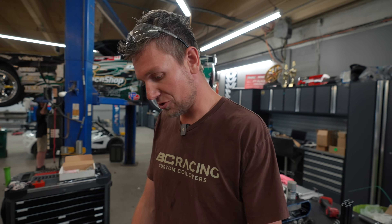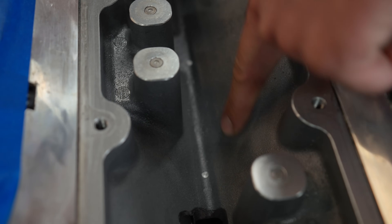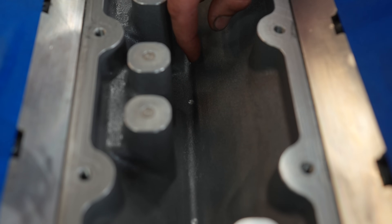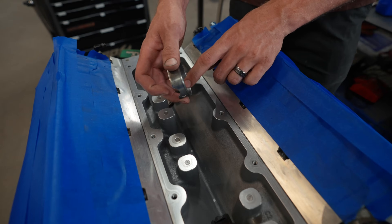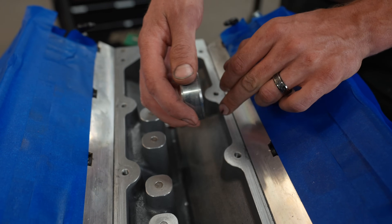So how do you do this? It's really hard — you can't get into it, you can't stake it, and the babbitt material is so soft you can't modify it anyway. I found a video on YouTube of a guy drilling through the top of the valley. So I put my pilot holes in already and we're going to drill down into the cam journal through the bearing and put a bolt in it. The bolt will be just below the surface of the cam material, so it'll stake it and won't let it walk in and out.